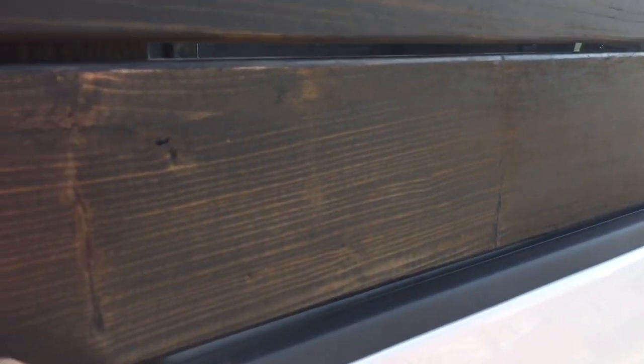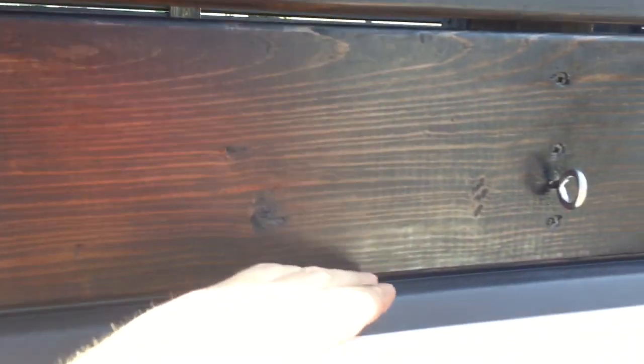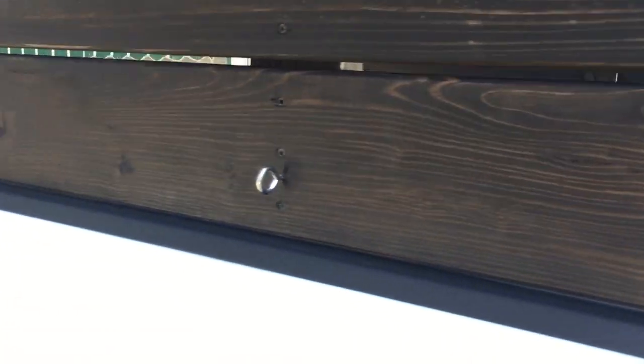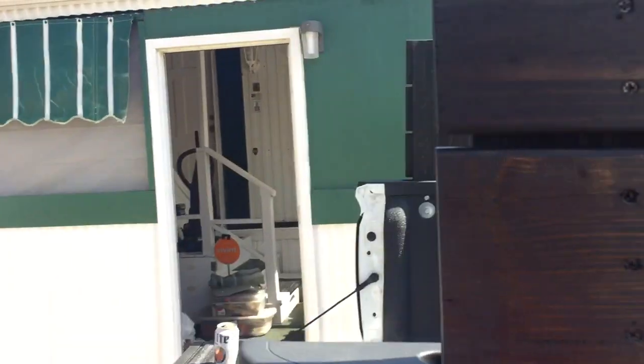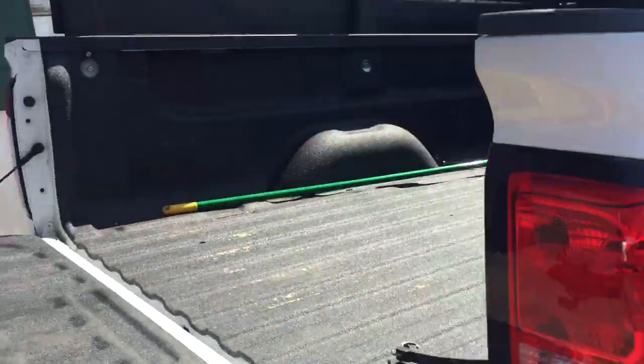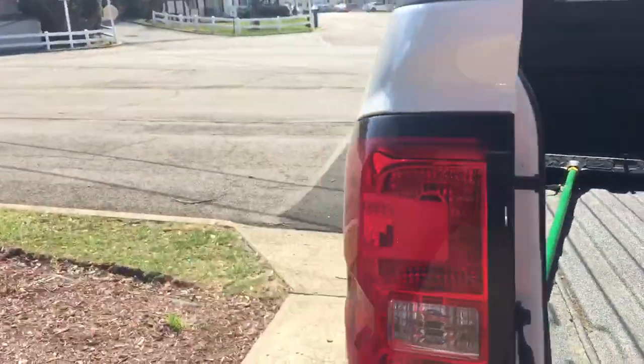These boards are five and a half inch by about an inch — actual size. One thing I found was a pain was these boards. I spent the extra money and got the premium decking boards, but they're not completely straight. Make sure you find a straight one for your first board or it'll look off. Try your best to space them out and pick the straightest boards you can. I don't want to go any higher than the cab.